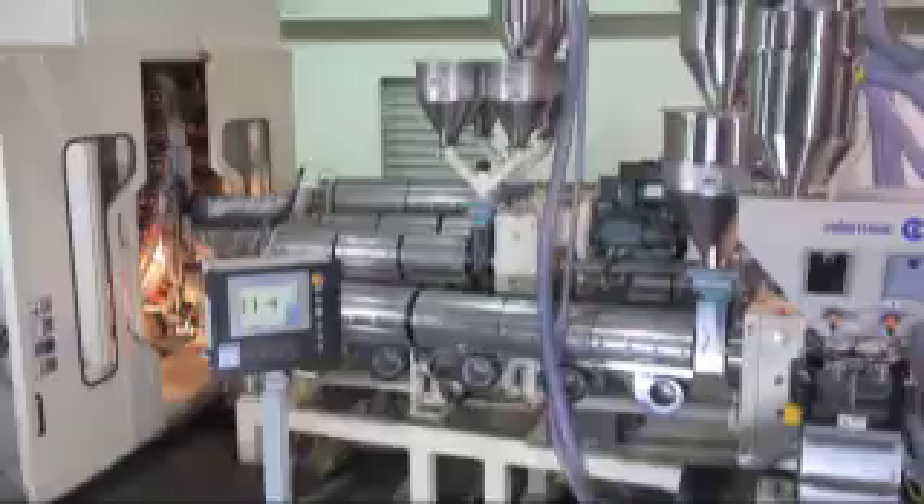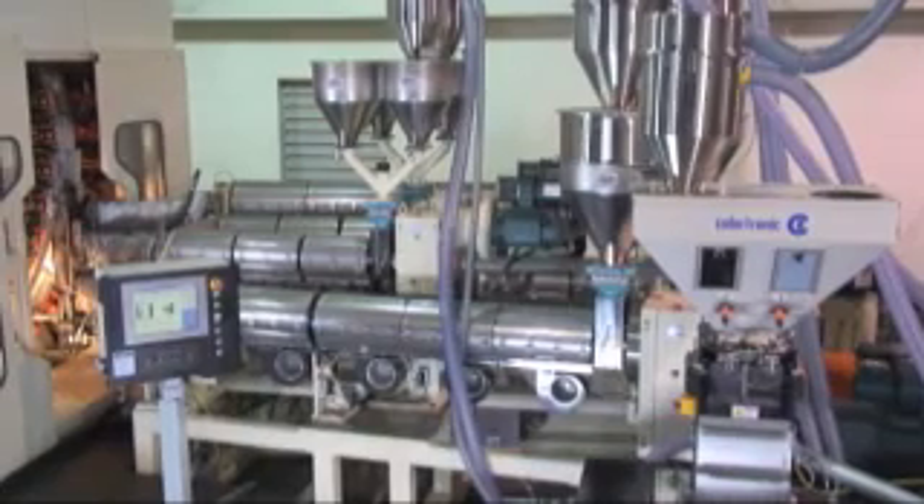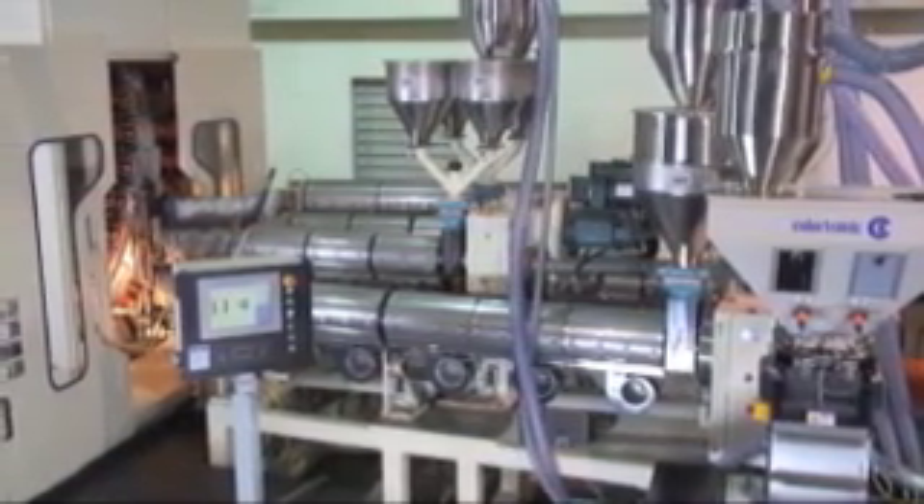The adhesive is split into two individual layers at the die head. To provide greater flexibility, individual extruders are provided for the inside and outside layer, even though the materials are typically the same. The plastic is melted in the individual extruders and formed into a hollow tube of molten plastic in the die head.